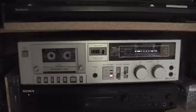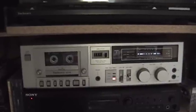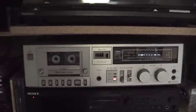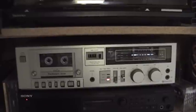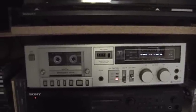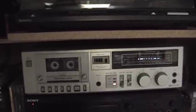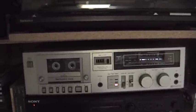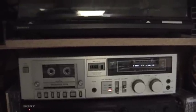The other thing that I think helped to make a case for Dolby B noise reduction to be included on every cassette deck, I dare say it's a safe bet, is that Dolby Laboratories was willing to license the Dolby B technology very cheaply. And most decks that I have seen typically integrate the Dolby B noise reduction function into a single, discrete IC that would be cheap and easy to put on a circuit board with a minimum number of required external components.